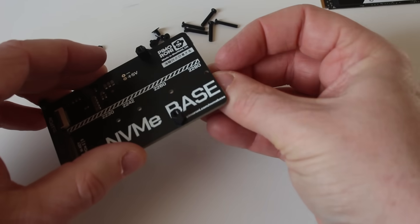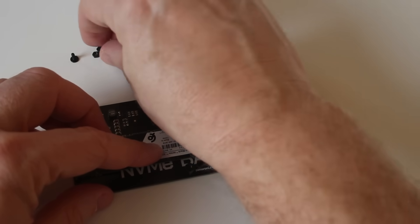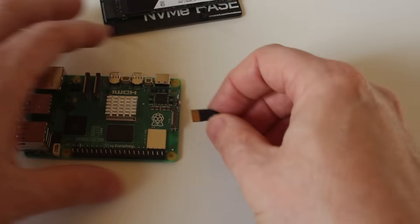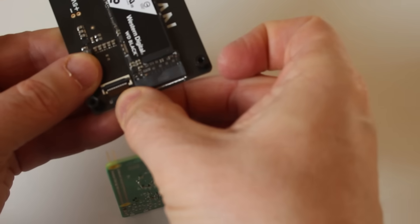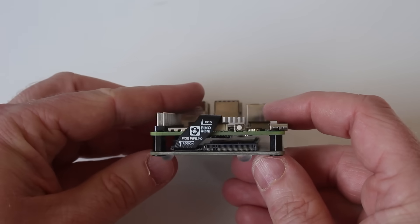You need to connect the NVMe drive. The best way I found — and I think it matches the official video — is to stick a screw upward from the bottom, put a nut on it, then put the drive down, and add a second nut. The most tricky part is connecting the PCIe ribbon cable connector. It has good arrows so you know which end goes where, but you have to pull back those ribbon cable connectors very carefully — I've broken too many of those over the years. Start with the Raspberry Pi end, orientate yourself, connect the other end, then screw everything in to make it secure.